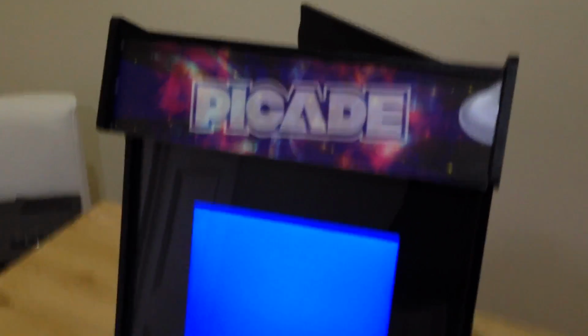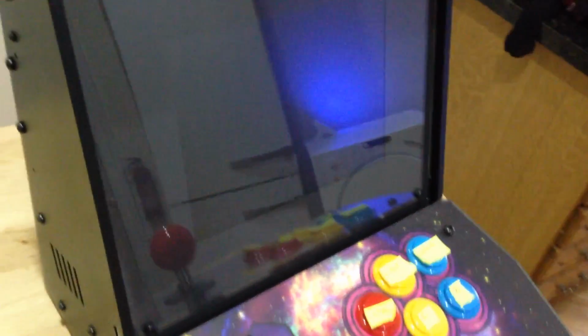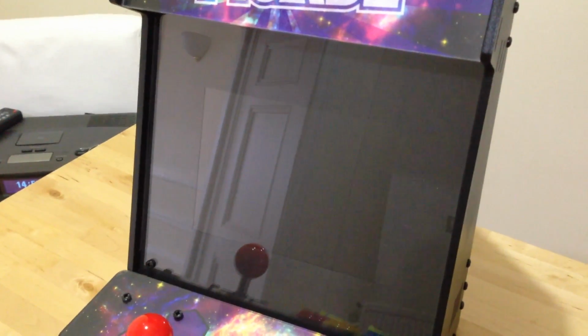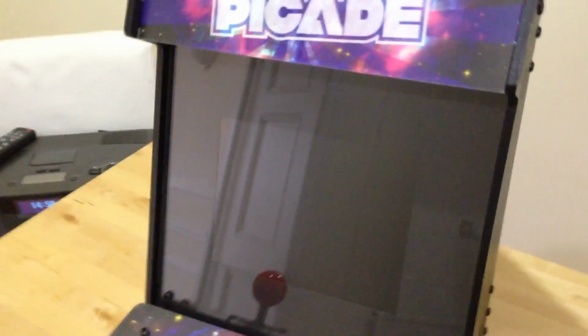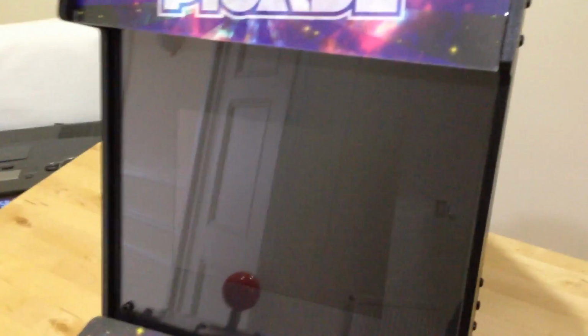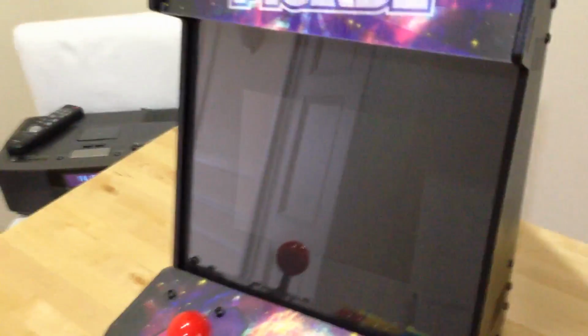I can hear the hiss there actually again from the volume, so I'll just turn the volume down a little bit there. Okay, so we saw the RetroPie splash screen. I've forgotten something. This is quite a good example actually, so I'll keep it in. It hasn't booted or visibly booted onto this screen because there's one file that you must change before you can boot, otherwise the HDMI process doesn't work correctly.